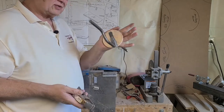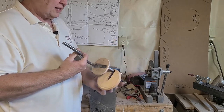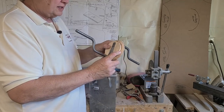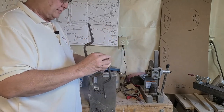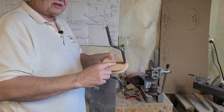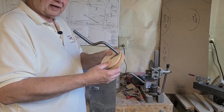Okay? When this is all ready and sanded smooth in here, go ahead and round the inside of the openings again. And you're going to use wood glue on this area. Center that up with your lines like that and glue both halves onto the crank. So it's going to be sandwiched like this. Then we have two little plugs you have to sand to a contour to fit down in here to fill this gap up after the outer pulleys are glued on. That completes your pulley on your pedal crank.